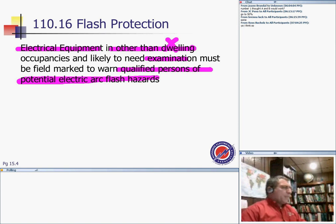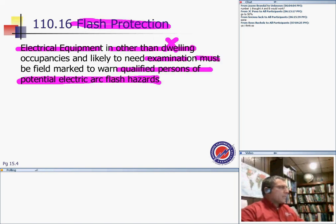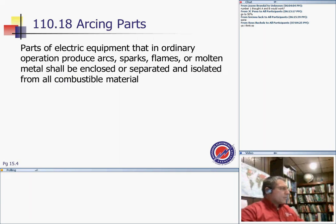At the beginning, I showed you an arc flash study that we did here at Dunwoody. All we have to do right now is just say arc flash PPE is required. But the arc flash label that we put goes beyond that, by OSHA, and tells you the exact PPE rating, category 4 or category 2 or whatever you need for this particular hazard. Very interesting, for basically electrical equipment that needs adjustment while energized and servicing. Any questions about arc flash? That's basically a major thing for all of us. Any question about the arc flash?